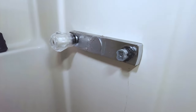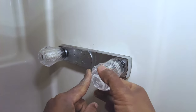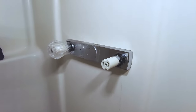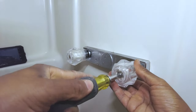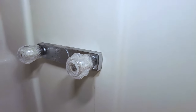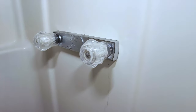That's on there solid. Now all I need to do is line this handle up - see there are little notches in here on each side, they line up with these notches here. First, get your extension adapter - that lines up perfect. You can see that's going to thread in very nicely, nice and snug. And voila - that's how you change your shower handles if the screw shears off inside of the stem or if the threads get stripped out.